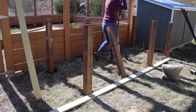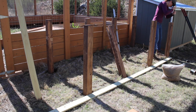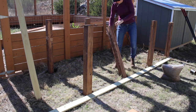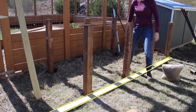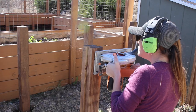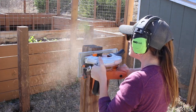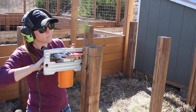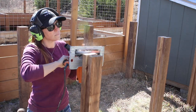I recommend you start with an end post, then hop down the line to set the other end post, then knock out the ones in between. You also want to make sure the faces are square to one another — I'm using a long one-by-four to test this. Next I made all of the posts level to each other. To do this I found the height of the shortest post then cut the top off the other posts to match. I did this with two passes using a circular saw, and this is far easier than trying to get all eight holes exactly to the same depth.